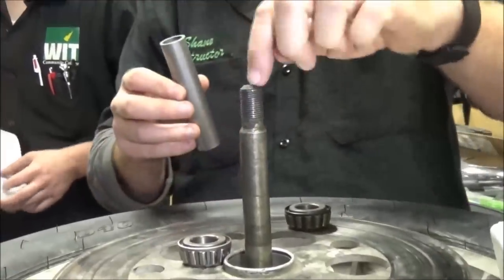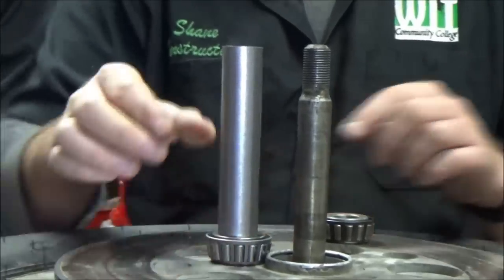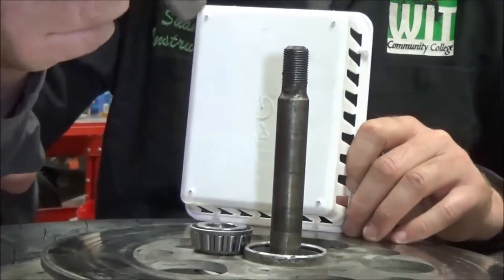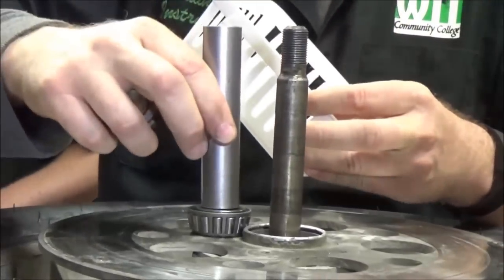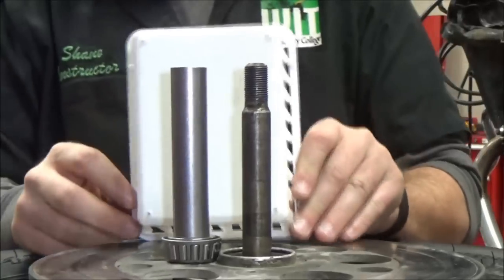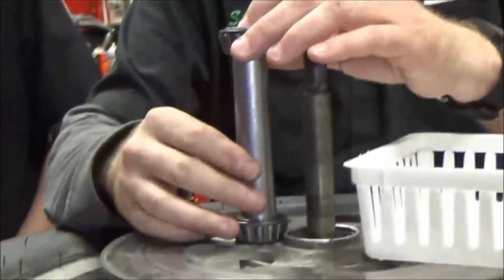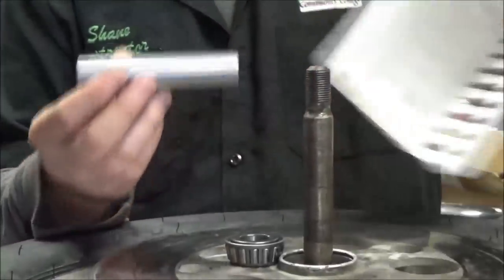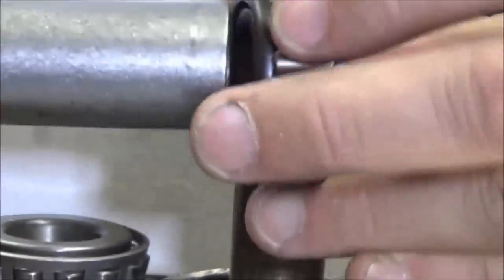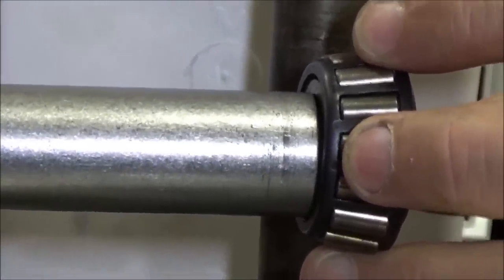We're going to do a little experiment here. This axle is straight up and down. I'm going to put this on the straight side just to prove a point — I'm looking at the distance at the bottom and the distance at the top. Would you say it looks pretty even? Okay, now let's put the sawed edge in its most dramatic place. What would you say? It's leaning. So it's a little bit — would you agree? Let's just settle on a little bit. Since that's not straight, when you clamp this whole thing together — zoom in here — instead of a good seat, it's going to have a little gap.